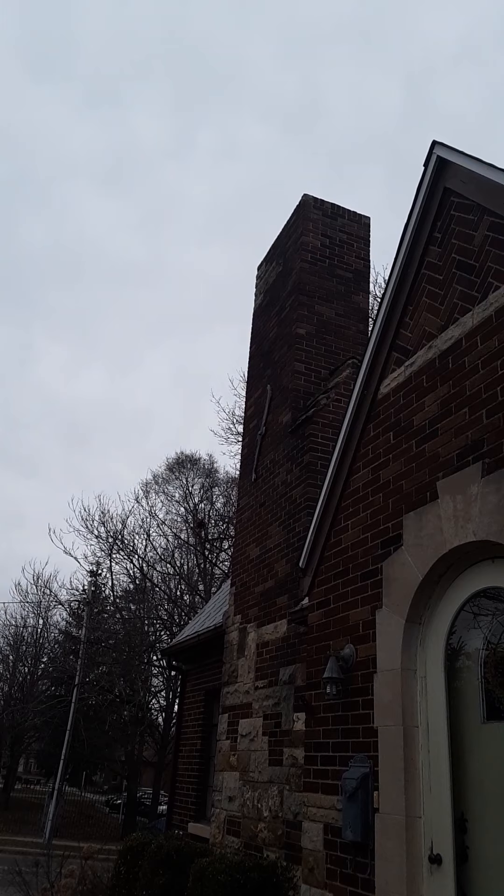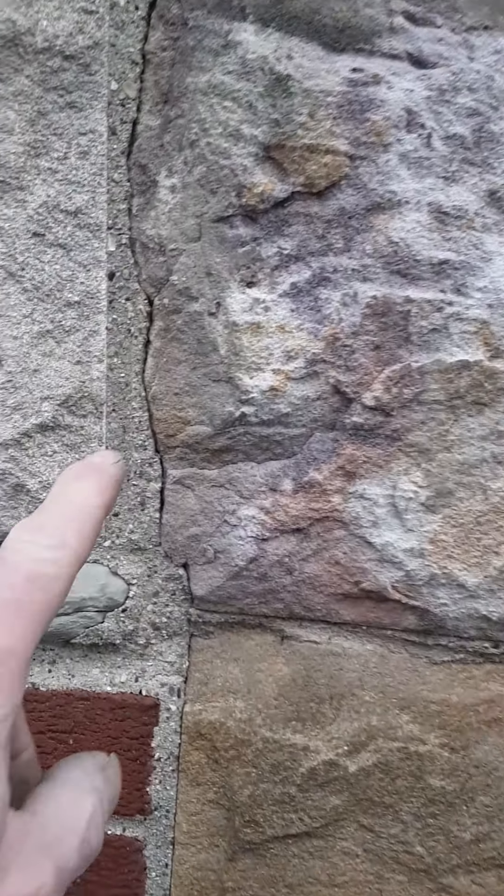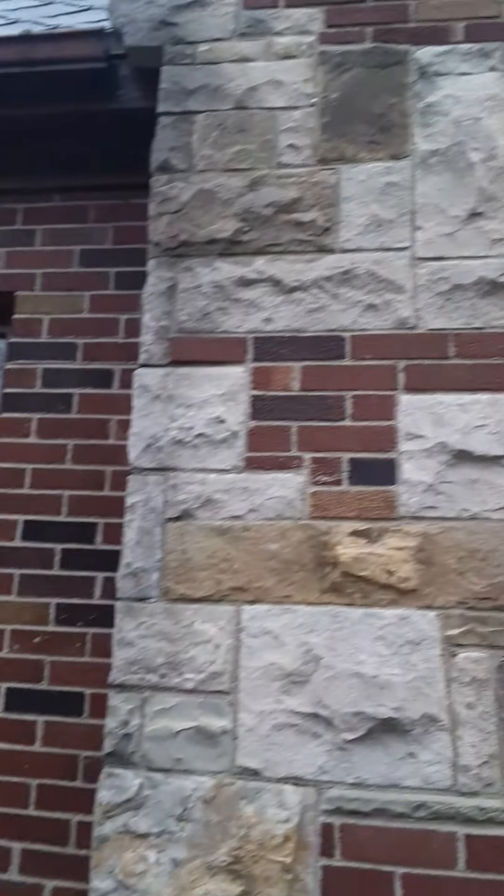Now for the chimney — it isn't that bad. You could fill a few holes on the verticals. Otherwise it needs tuck pointing where they stopped up there. See the new mortar they put up here? It needs tuck pointing from here to here. And the stones are kind of getting cracks in between them too — it's not the end of the world. A lot of work fixing all those cracks in here. You have to decide if you want that done before we add that in — there's a lot of work.